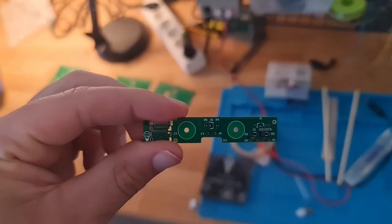That's the board that Bob made — it's used for the M5 Stack e-reader. It's got a USB feedthrough, meaning just USB in, USB out. Bob needed the reflow oven for the USB-C because that's quite difficult or almost impossible to solder by hand. So you just put some solder paste on — you can see J3 — put the components in, and the reflow oven should solder them quite nicely.